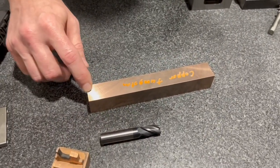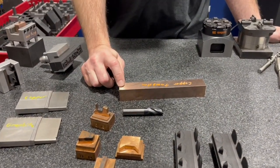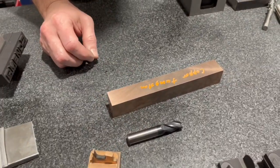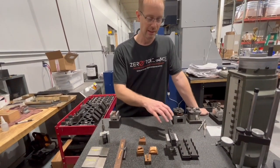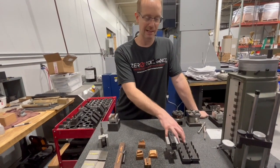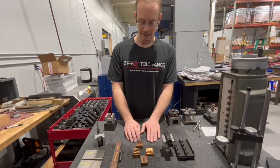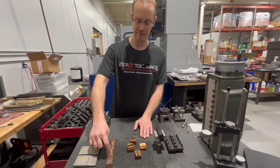The settings in the machine are set up that way, and the technicians and scientists at Poco recommend doing it that way. Copper tungsten is designed for burning carbide and other materials like that. What I would recommend for my shop: use graphite electrodes for 99% of what we burn. If you need a super specific fine finish that you cannot touch or bench, I would use copper. If you have something very complicated in carbide, I would use copper tungsten.